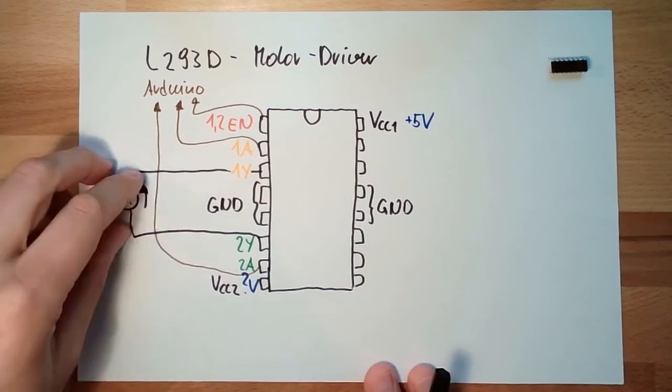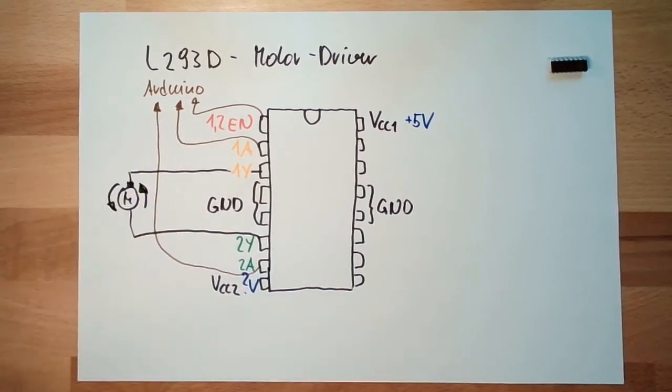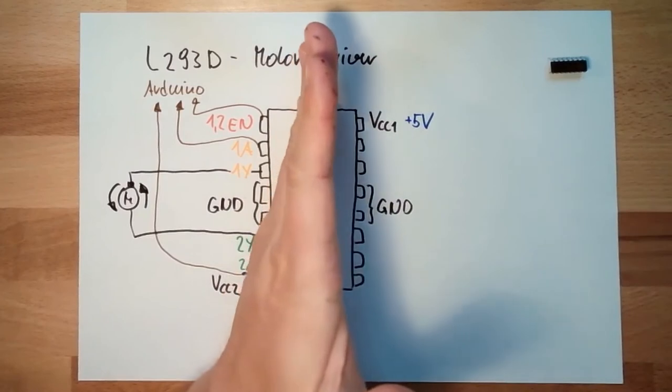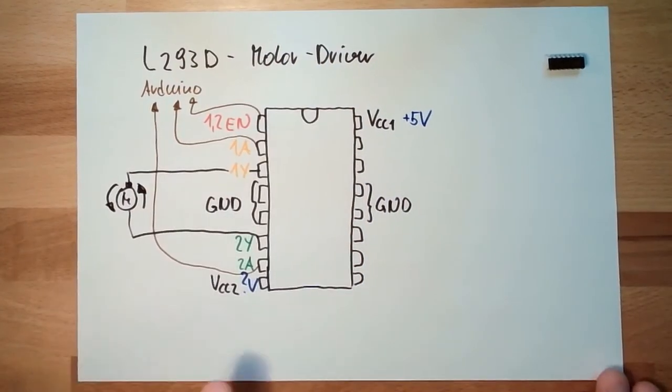There's a little bit more to the motor driver: there are diodes inside, which are needed to handle the motor's inductance. You cannot simply turn off a motor — a free-wheeling diode is needed to let the current decay gently and not abruptly. So we can select if the motor turns left or right, all with just one side of this motor driver.